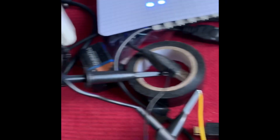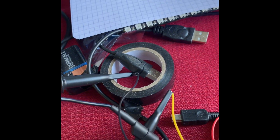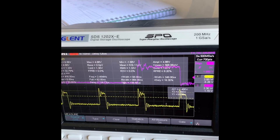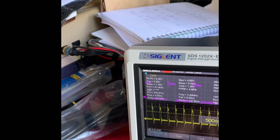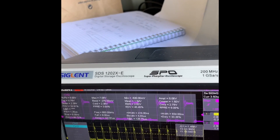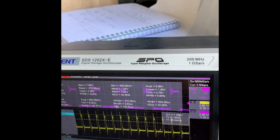That's what I wanted. Now if I go to my data line — let's take that and put it here — one of the lines, let's measure. We can see that on the data line I've got a speed of 800 kilohertz, which is the speed of the WS2812.